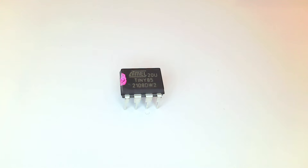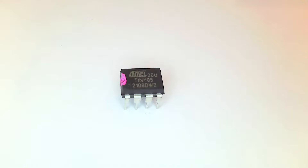For our little project, I've chosen the ATtiny85. This tiny little thing is an 8-bit microcontroller — that doesn't mean it can't handle numbers bigger than 255; the compiler emulates larger numbers for you. It has 8K of ROM, 1K of memory, runs at 20 MHz, and doesn't need anything external. There is no need for an external oscillator — just drop in the usual 100nF cap on the supply voltage and you're done.